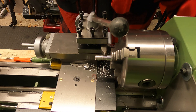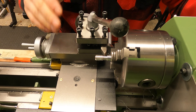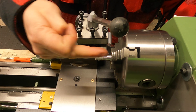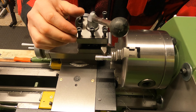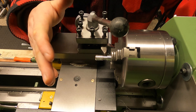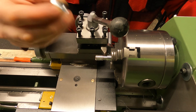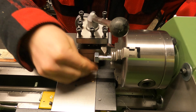There are many different ways of cutting threads on the lathe — this is just the most basic one I could think of. To recap: I engaged the half nut and kept the carriage locked onto the lead screw the entire time, moving forwards and backwards without ever disengaging it. This means you'll never get any error from disengaging and re-engaging the half nut. For aluminium and brass this is a really easy method. As a rule of thumb, go to half of the pitch thread — in this case 1.5mm, so I went to 0.75mm — to check if the nut fits, then take it to your final size.